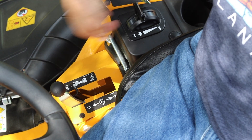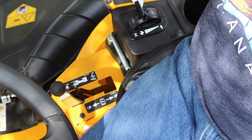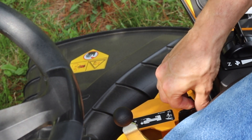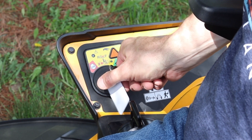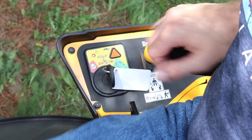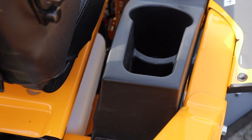One part of this mower I occasionally forget is this setup right here — this is how you lock and unlock the parking brake. You have to lock it every time you get off the mower or when you shut it off, and then when you turn it on and you're ready to start mowing, you move it to the unlock position. To the bottom right is the freewheel position, which unlocks the hydros if you want to push the mower or tow it. There's one other safety feature that took a couple of days to get used to: if you want to mow in reverse, you have to turn the key to the left, push that little triangle until the light comes on, then you can turn the mower deck on and mow in reverse. If you skip those steps, the mower deck will just shut off when you try going in reverse. And here's a look at what I call the command center — there's an hour meter and a cup holder, which can really come in handy on those hot summer days.